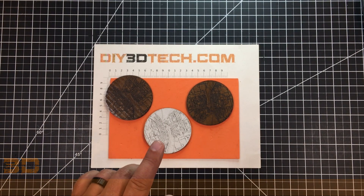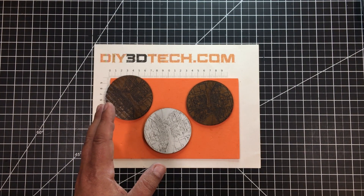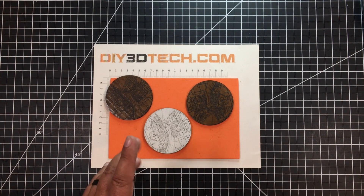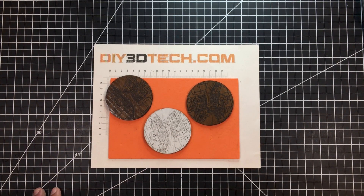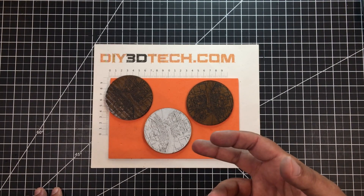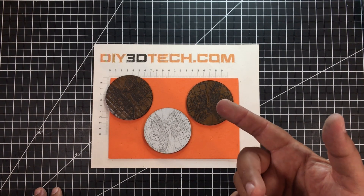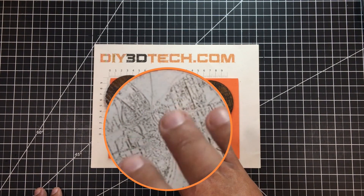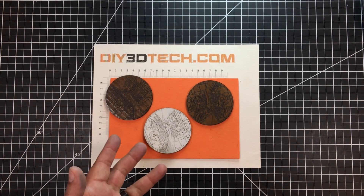Once this is cut, take some compressed air and blow the ashes off, or else you'll smoosh the ashes into the white. Also increase your cut by one more pass to get a clean cutout, because the first one or two cuts on white are going to be mostly reflected until it makes that first burn through. For the etch at one pass, you'll need to throw a little more power to get it through — you can see some weaker spots where it didn't totally come through.